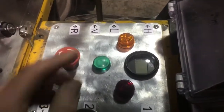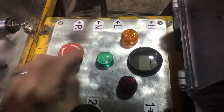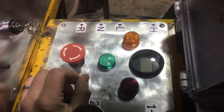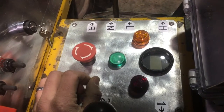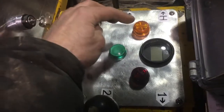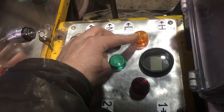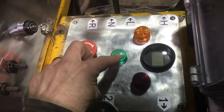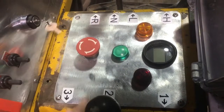The new dash has a tachometer for motor speed, which also serves as an hour meter, and an emergency stop, which will probably cut power to the main contactor coil and disconnect the battery — so under any circumstances it should work as an emergency disconnect. This indicator will come on briefly when you turn the ignition on to show a pre-charge delay, then go out, and the green will come on to say all good, ready. Red will indicate a fault or emergency stop.